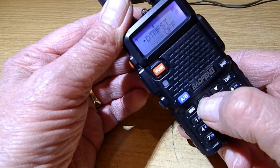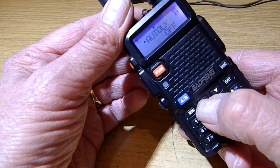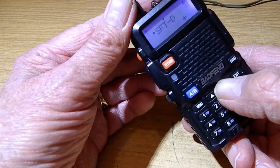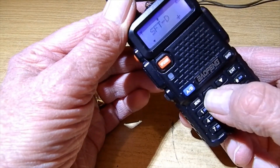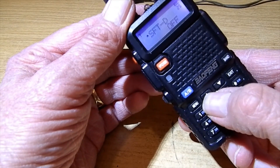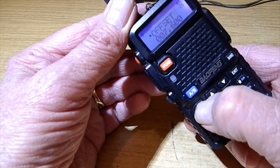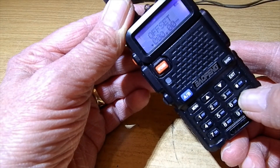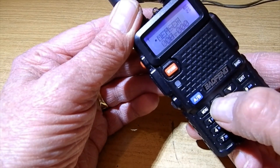This is a simplex channel, so keep going up. Shift direction: press menu, go to minus, then off. Press menu, confirm. Keep going up to offset: press menu, type in all zeros - 00000000 - press menu, confirm, confirm. I think that's the lot.